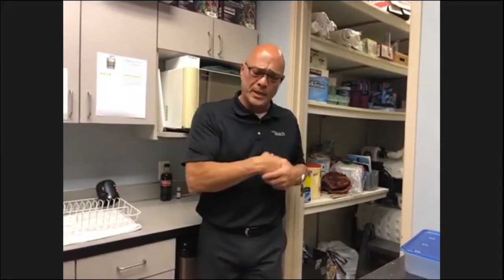Right. So we always recommend a vacuum line cleaner that has a live enzyme. There are detergents out there, and mainly what the detergents are doing is killing any bio growth that's happening in the pipes, but it doesn't really clean out the pipes as they go along. The live enzyme cleaners are all natural. They have a live enzyme that goes in there and sets in the pipes and actually eats away at all the bio growth that's going in the pipes, so it keeps them constantly cleaned out.